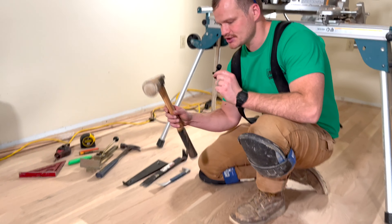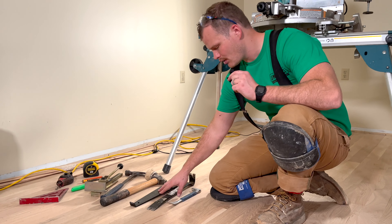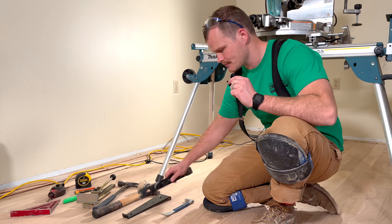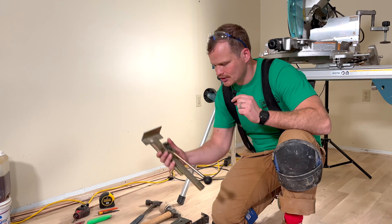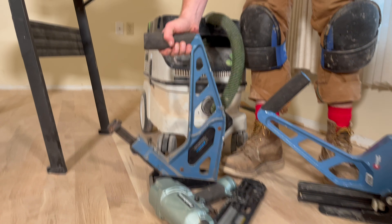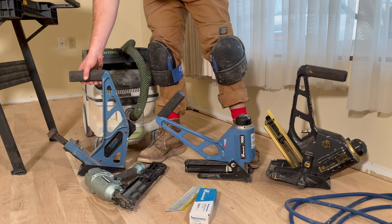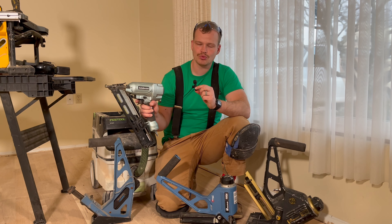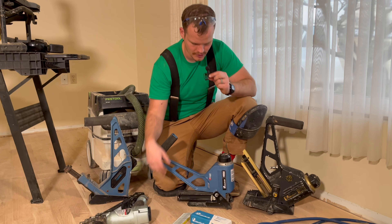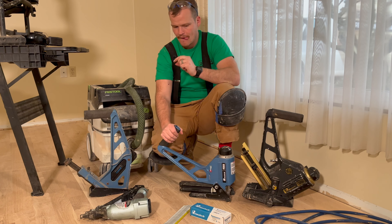We've got our soft-headed hammer — we've got to have this for hitting our nail gun and to keep us from breaking our boards while we pound them in. You can see we have a few different types of pry bars; the flat bar is the one you absolutely have to have. This wall jack is not optional — you need it to close your gaps; it's an Amazon one and I'll drop a link below. As far as nailers go, we have a manual cleat nailer, a power cleat nailer, an edge cleat nailer, and a pin nailer. You're going to need one main cleat or staple gun and the pin nailer. The edge nailer is not available for rent, so unfortunately you'll have to do without that one.